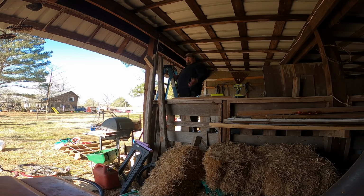So now I've got my wire pulled out here, and I can put my switch and my cover plate on and go ahead and close that part up, because the only thing that's going here is a light switch, and I just need it on the hot side to be able to turn the lights on and off. Otherwise, it's just running a wire to the LED lights and the negative wire back to the control from each end of the LED lights. So let me get that started.